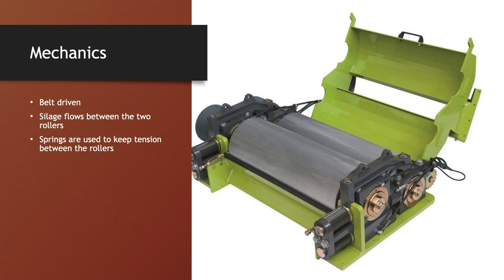The processor is placed directly behind the cutter drum of the chopper. As the silage goes through the cutter drum, it goes up through the bottom side of the processor and out the top through the spout. As it goes through the processor, the rollers are turning opposite directions of each other, which is shredding or demolishing the corn silage as it goes through. The reason for this is because the cows need to be able to digest as many nutrients as possible, so by having the processor unit in the machine, it breaks up all the corn kernels so that the cow can digest as much as it possibly can.